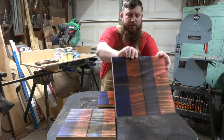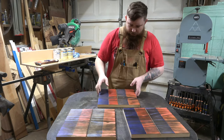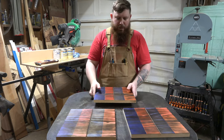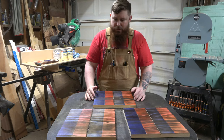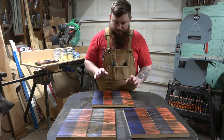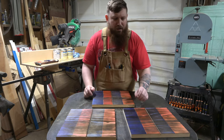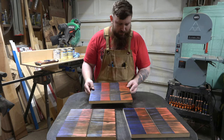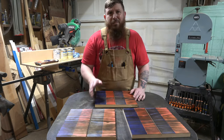So that's the Varathane, here's the new Minwax, and here's the old. I'm actually kind of surprised, because a lot of people have been giving this new Minwax some bad reviews, but to me it actually performed much better than the old stuff. Either way, I don't think I like using Minwax thick without wiping it off — both of them look much better wiped off. But I really can't say that the new stuff didn't perform at least as well as the old.